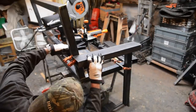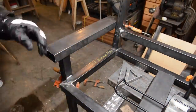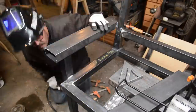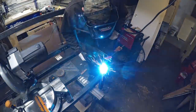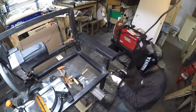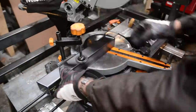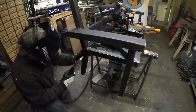Here I am setting up the armrests against the front legs, taking extra care to make sure everything's parallel and square — you see me using the speed square. I'm pretty confident I got everything where I wanted so I laid down some heavy beads, tacking under the arm so that later the inside of the arm and inside of the leg are in the same plane. Then I'm laying down beads on the opposite side. It's important in my workflow that if I weld in a particular pattern on one side I try to remember that same pattern on the other side to get all my beads where they need to be.